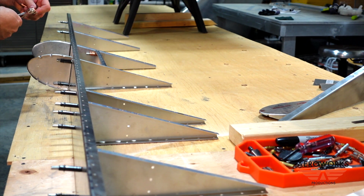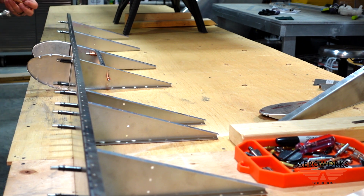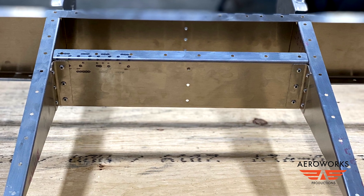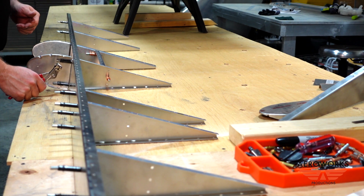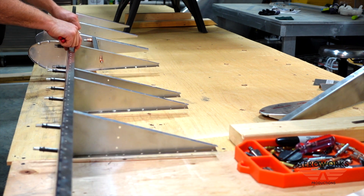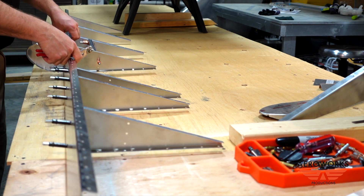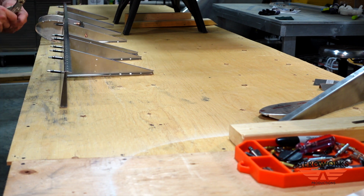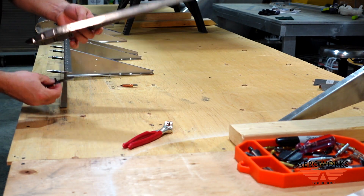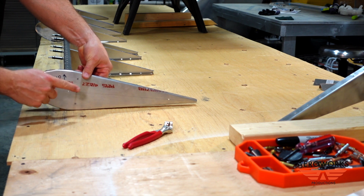I've already somewhat assembled the V section in the back — the trailing edge. Pay attention to the direction of those flanges because on the center portion, the rear spar — the little mini spar — it faces forward, and the angles are on the back side, not the front side. Otherwise you'll end up with the spar too far back and it'll stick up too high. So there are our seven ribs, our rear spar, and our nose ribs. Now we'll work on getting the angle brackets on the end as well as our end ribs. But before the end ribs, we're going to have to put that hinge pin through — marking holes and drilling it out so that when it gets all riveted together, we'll have a hinge pin on there for mounting.